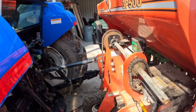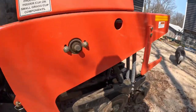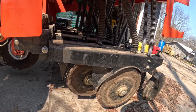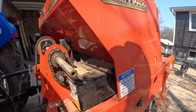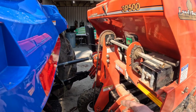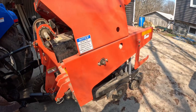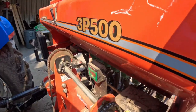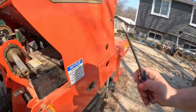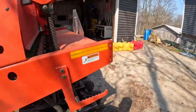I'm going to make sure all these tubes are free and clear of any debris. I went through and crimped them to make sure there was nothing stiff in there — mud daubers or a nest. The true way to check it is with the drill raised in the air, since it's a ground-driven machine. I'll spin this tire and make sure there's an even distribution of seed dropping down onto the cement. You can hear it dropping through the tubes, and it looks like every single one of them is dropping — that's what we're looking for.